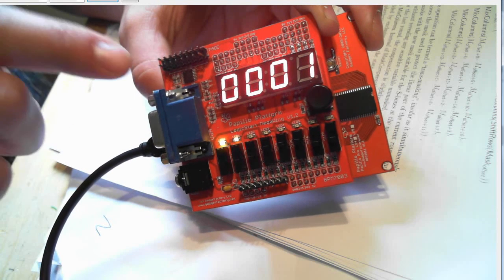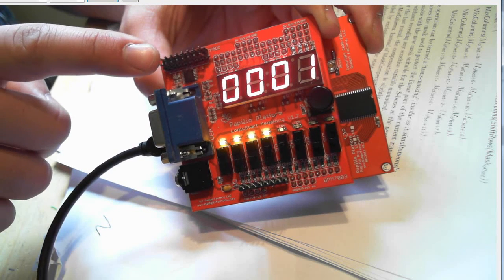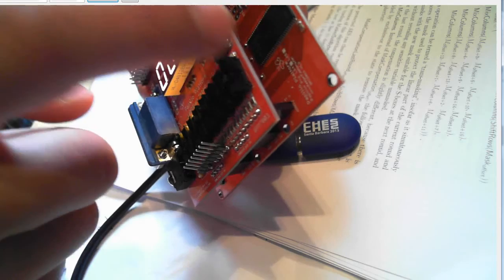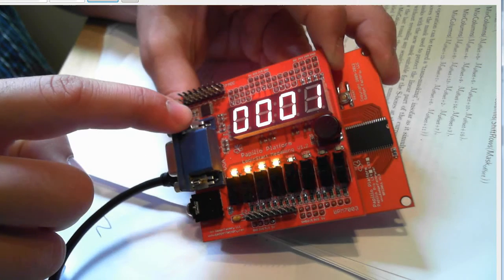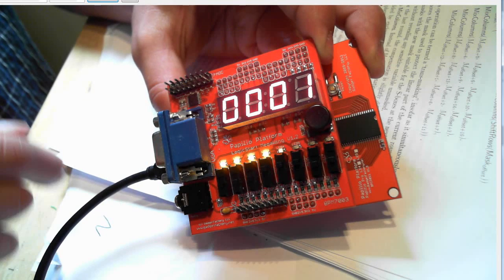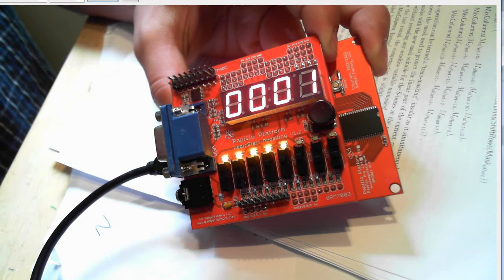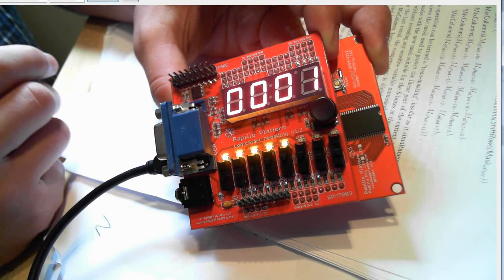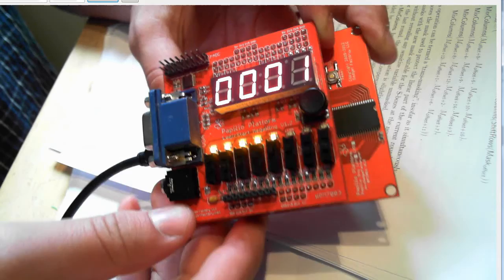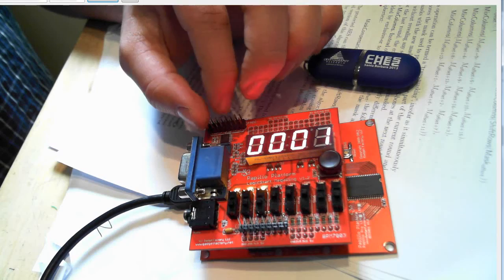And of course you could do this with a standard microcontroller, but it's not quite the same. Because you may run out of pulse width modulator channels, or you'll be very busy dealing with just the pulse width modulation. This way, the microcontroller just deals with reading from this SPI ADC chip, updating the pulse width modulator settings, and then goes and does other stuff, and then says, okay, what's the new ADC setting? So it has much less overhead, and it pushes off to hardware the stuff that hardware is very good at doing quickly, the counter. That's easy to do, whereas doing a complex state machine for reading the SPI flash is better handled in software. So that's a complete example of programming a soft core microcontroller using the Papilio Pro and the ZAP IDE release.